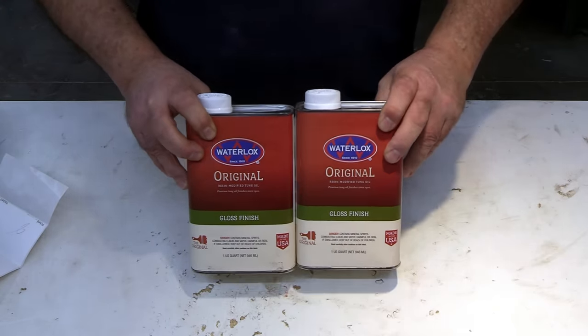Now, I personally find harder woods, and we'll classify these pods as being in that category, you tend to get more chatter. And chatter is, I'll call it vibration. Basically, the wood is vibrating, and it's kind of skipping on the cutter. Here I'm noticing it, and I'm trying different things, and sometimes I put my hands on the outside of the bowl to try and calm that down a little bit, and that wasn't doing anything. But in this next clip, I've got the volume turned up to 50%, and you'll hear what I mean by chatter.